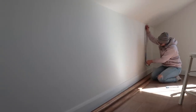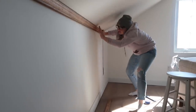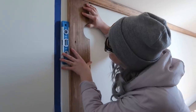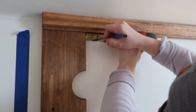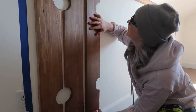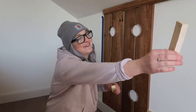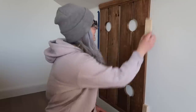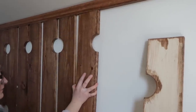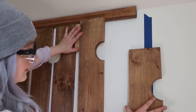My plan was to simply assemble the headboard right on the wall. This lets me adjust any boards should my math not be up to snuff due to some janky walls. I made sure the first board was straight using my level, secured it with my brad nailer, measured over one inch, and secured the second board. After one set was done, I measured over an inch and a half and started it all over again. I got through two sets before I broke down and made two little jigs of one inch and one and a half. So now I can just work my way across without worrying about measurements. It was all hunky-dory at that point — just popping up boards and securing them with my brad nailer.